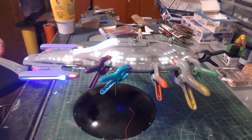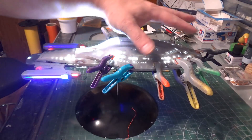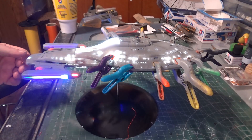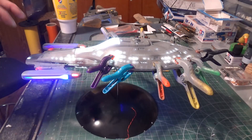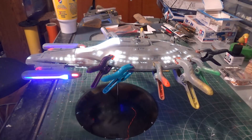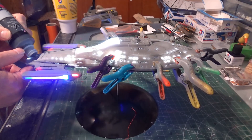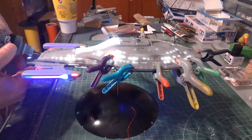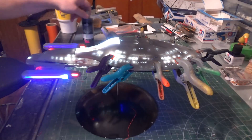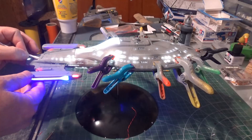You can see all the windows are glowing from behind. All I need to do is finish the painting on the top, but everything is looking good. Now I am going around and checking for light leaks beyond which I want to have. I can see there's a big light leak here at the back of the shuttle bay where that shuttle bay bulkhead doesn't quite meet. I'm just squeezing in a little bit of tulip and coming back and wiping that off.